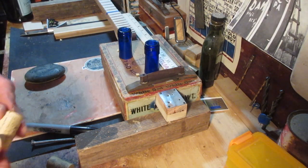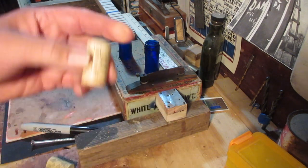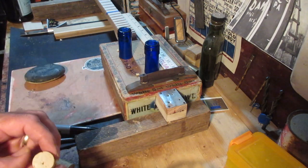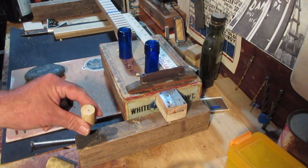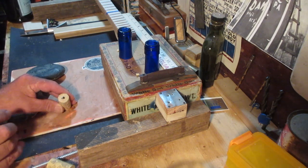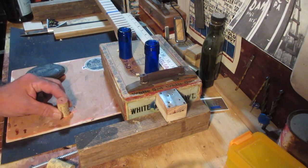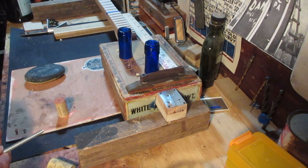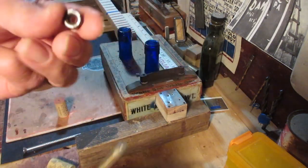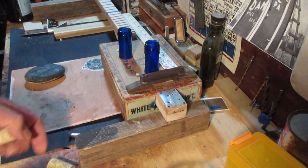One thing to know about the cork is that one end is narrower than the other. You want to know which end is narrower. Next, you want to find the middle — for you metric haters, these are about 20 millimeters across, so about 10mm in is the middle. I'm going to put a mark about where the middle is. Then I can find a long screw like this, or a bolt with a nylon insert nut and a couple of washers. The idea is I want to run it through the center of the cork.